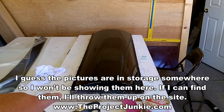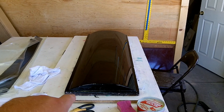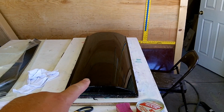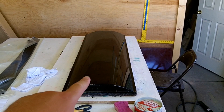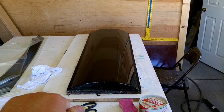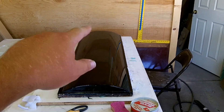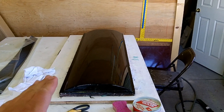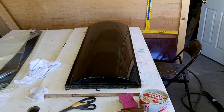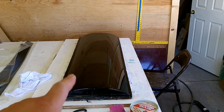You can see here there's a base of melamine. Once I got the black part of the mold done, I stuck that on top of this melamine — the base of the black part is also another piece of melamine. Then I attached some two-inch extruded polystyrene — the blue or pink stuff you can find at Home Depot, Lowe's, or your local hardware store. I laid that in there, then put two templates on each end. I took a hotwire longbow and cut that out to make the shape I wanted. After that, I put some fiberglass cloth on there and vacuum bagged it to the foam core.